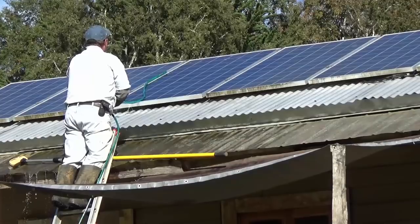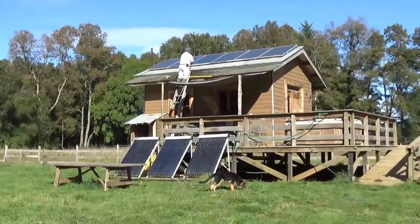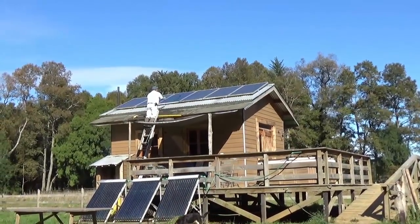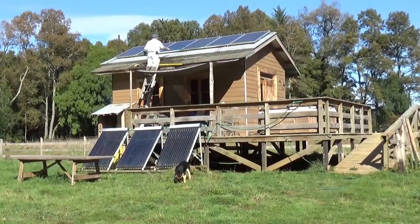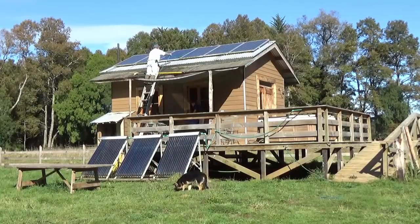Make sure no mice ate anything or anything like that. I didn't show that because I climbed under there a couple of weeks ago, and everything was fine. But the other thing is you also need to make sure that the inverter's fans are nice and clean. They're not clogged with dust, like a computer fan would be clogged. Some really nice systems have filters over their fans, and you can clean those out.